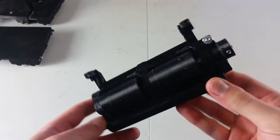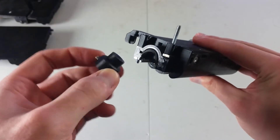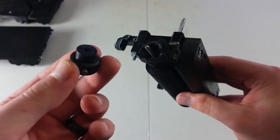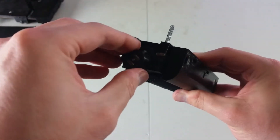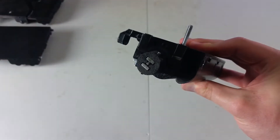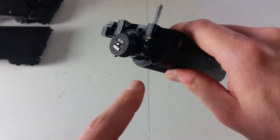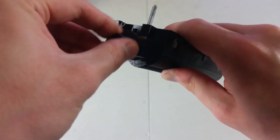So I moved the brake to the side. There's the same disc as before with a piece of neoprene around it, and this version doesn't seem to squeak as much because there's more neoprene so I don't have to tighten it as much. It's now really easy to replace — you just take the disc off, grab a new one, tighten down the set screws, and you're done. The tightening is done with a thumb screw so it's easy to turn, and it pushes down to wrap around the disc and create more resistance.